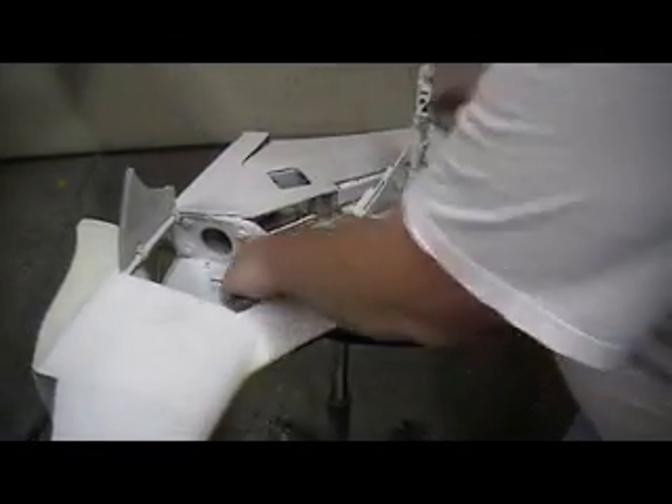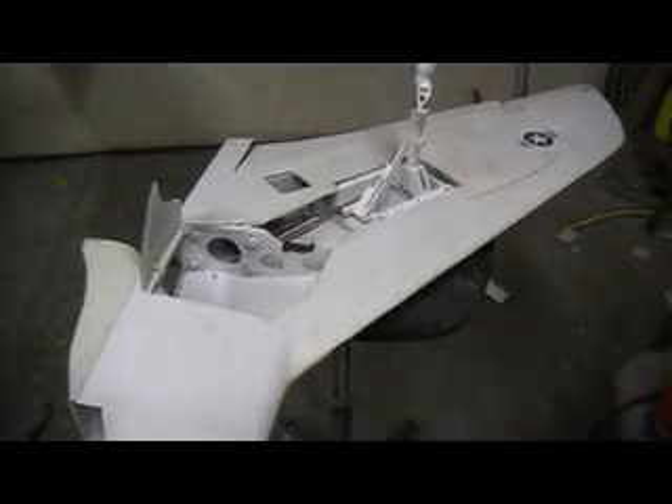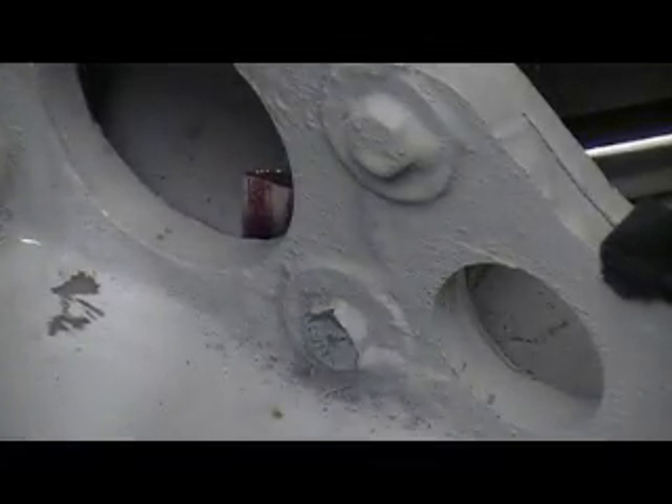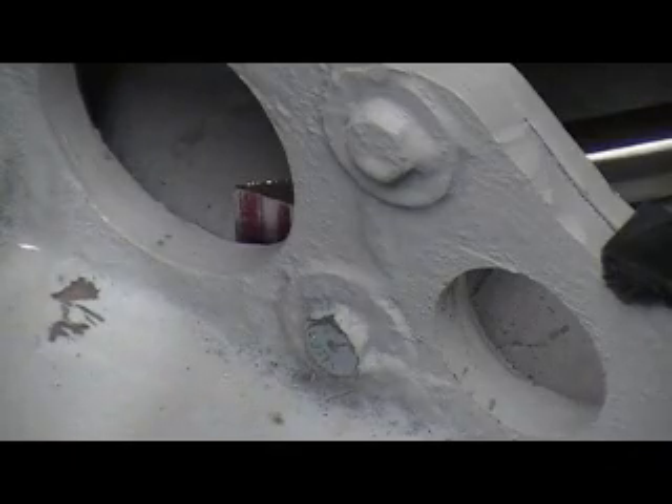What I've got to do is I've got this bolt right here, bolting my spar into that piece of wood. I'm just going to take that bolt out — this plate is right behind that bolt. I'm going to take that bolt out and mark on this piece of aluminum where that is. Then I can drill that out and tap it and it's going to work great.